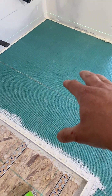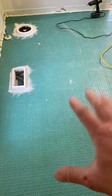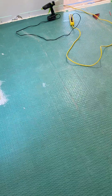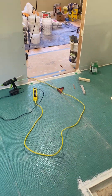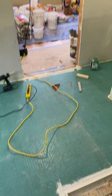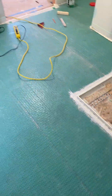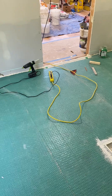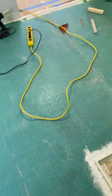A few of the reasons I like pouring over this membrane instead of pouring first and then putting the membrane down: one, I don't have to do a lot of prep to the subfloor — I don't have to prime it, I don't have to fill my joints or anything like that. This handles a lot of that. Two, most self-leveling products aren't suitable to go directly over OSB subfloor. There are some out there but not all of them. The one I'm using, HFL, is not specifically recommended to go directly over plywood.